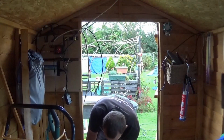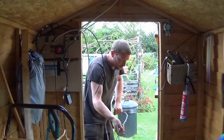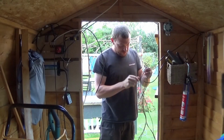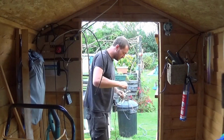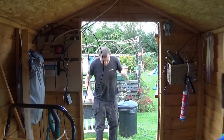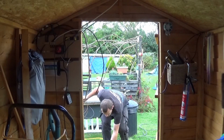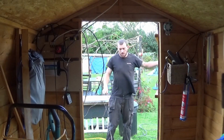So, the brown one can basically get swapped off just down here, because that's going to the battery, right? And what I'll do is, with the black one, I'm going to run up around here, out, into the negative side of the solar panel, and then we'll chop it off, and then the other bit, connect into it again, down and around, into the battery. Negative side of the battery, I should say. Once I've got it all entangled, that is. Wire for days. And then, hopefully, it doesn't rain and there's enough sun to see if the pump works.